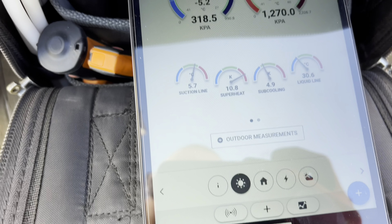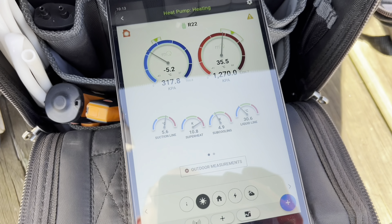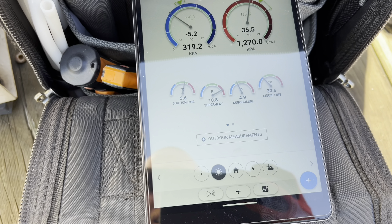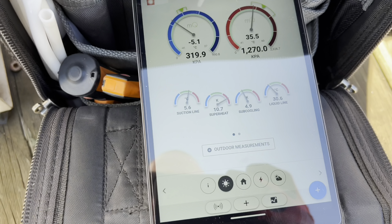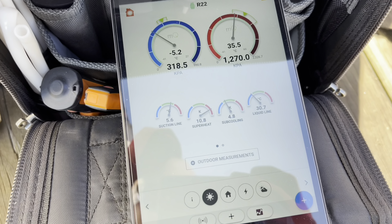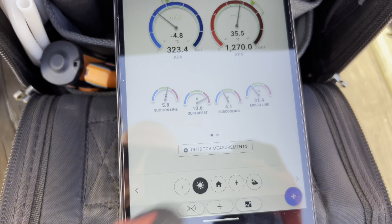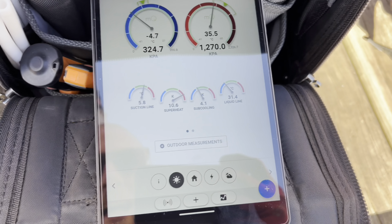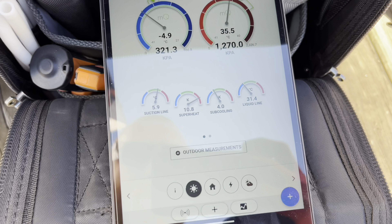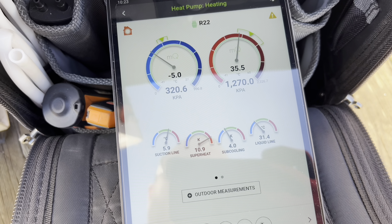Made a slight change — not as much as I was hoping. I am getting my sub cooling reading from my discharge line — there's no liquid line on this thing — so that's a skewed reading. I'm still leaning towards this thing being low. We'll make maybe one more adjustment. If nothing changes, we'll have to go down the path of looking for a leak. It's an R22 unit. After a couple of adjustments, this is basically all I'm getting — I think this thing's low. Taking our sub cooling number from our discharge temp, I'm going to assume there's actually no sub cooling. High superheat — we'll shut this thing down and go get the leak detector.